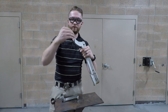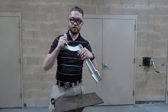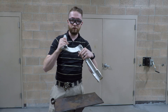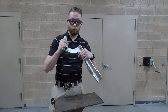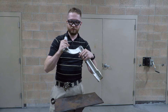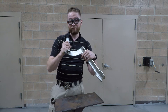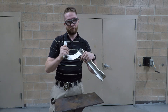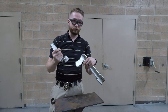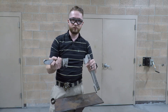As I weld from both sides alternating — one, then two, and probably three and four passes — I'll then take it straight to the bucket of sand and let it cool down nice and slow. I may even heat it up one more time with the torch before I put it in the sand, just to make sure it's nice and warm. I've seen people put it in an oven, or in a barbecue. All those methods work if you have a fuel torch, oxy-propane, or oxy-acetylene torch — that's what we're going to use today.